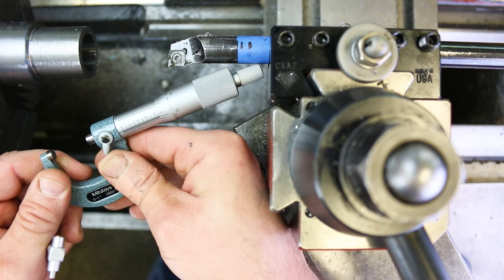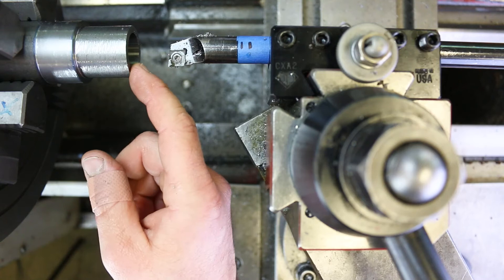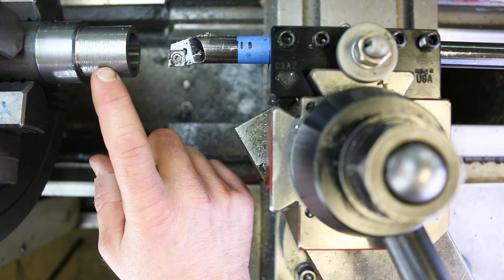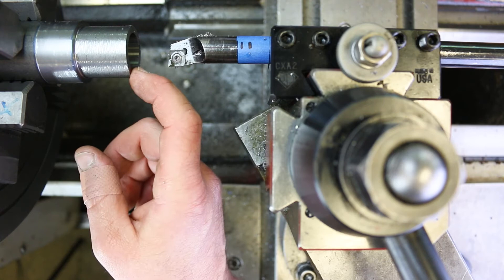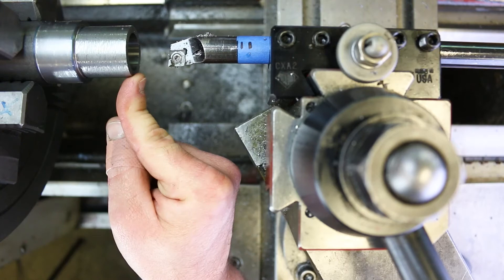Now we're going to quantify that surface finish a little better than just feeling it on my finger. I'll show you how to do that on the outside diameter because it's easier to see that finish. When we finish all of this and do the final inspection, we're going to use something called a profilometer — but that's going to be another video. Remember that if you were going to make the second bushing, all you'd have to do is machine the inside diameter out another ten thousandths to get to 885. I'm going to clean up this tool and remove the insert.